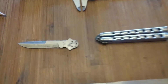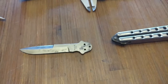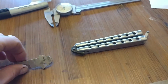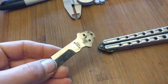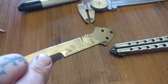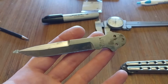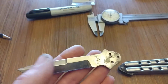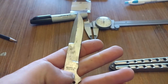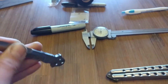This is the Trade. It's supposedly made in the USA — I'm not going to dispute that — but the tolerances sucked. Major blade play, more blade play than some China cheapies I've owned. I've owned Jaguars that held tighter tolerances. Second, I Rockwell tested it and you can see lots of dents in this because I didn't believe myself at first. It Rockwell'd very low, like 55–56 HRC. Yeah, this is a very low-hardened D2 blade — Strider says that's what they use, D2. Manila folder, made in USA.